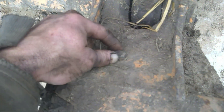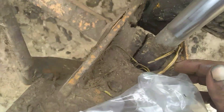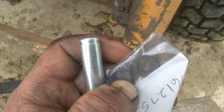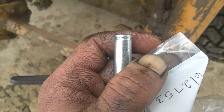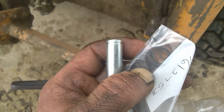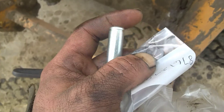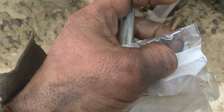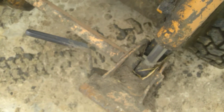And these are the pins I got to change. I just stuck bolts in here — it doesn't work the greatest, but it does work. Originally these pins — the original pins took these little goofy clips on both sides, E-clips I guess you call them. These new ones have snap rings, so they ought to work a little better. They had a clip on each side and they'd fall out or rust out and lose the pin. New ones here actually have a back to them, so they should stay in there a little better. The snap rings are a better setup too. That'll take care of that problem.